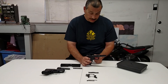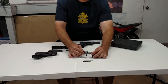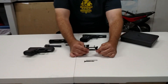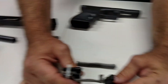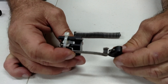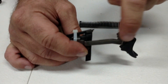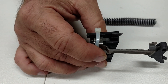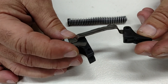Next is the trigger. The stock Glock trigger — this is the trigger group I'm going to refer to it as. The stock setup is too heavy in my opinion, and it's also gritty and spongy, everything being plastic, especially the shoe. You can easily reduce the pull weight by just changing out the connector and the spring, and that's done relatively cheaply. But once you've gotten into here, you might as well swap out the whole unit in my opinion.